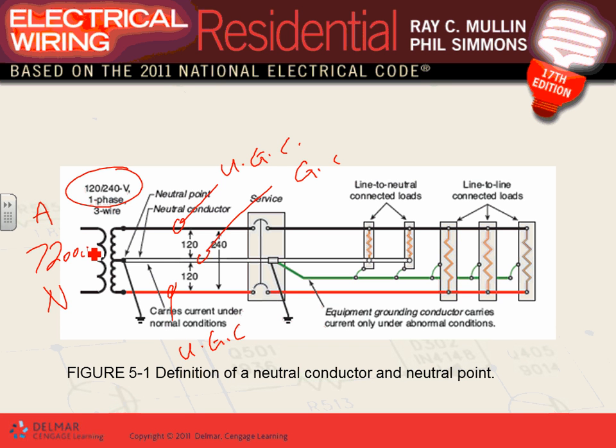So they split it and they give you what we use in residential, 240/120 in the US. Ungrounded conductor, grounded conductor. And of course, then we go to the service. Can you guys see we put your service conductor? You ground the neutral right at the service, a must in the US. And then we pull the green conductor, which is the equipment grounding conductor. The term for it is equipment grounding conductor. That's it. And then the neutral is white or gray or three white stripes,